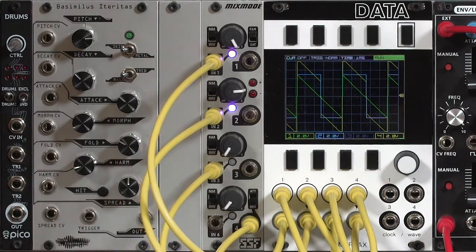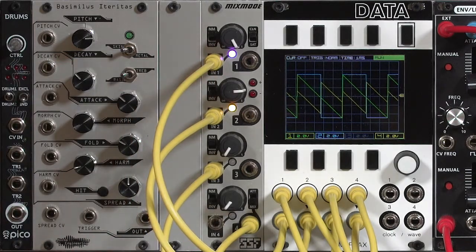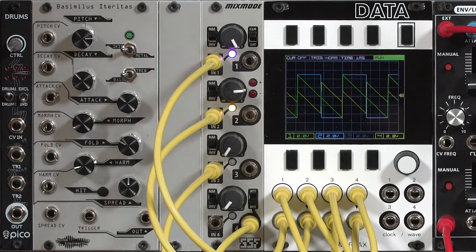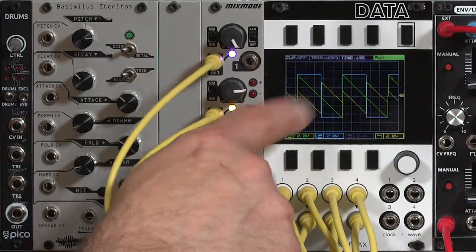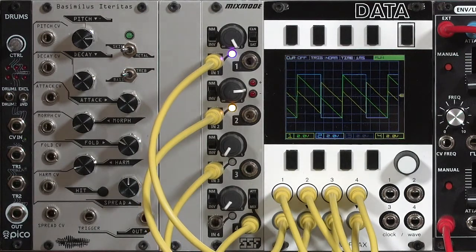As I invert one — in this case the square wave — you'll see the composite wave is quite different. We're kind of building a double frequency sawtooth in this case, as we're inverting the sawtooth partway through by adding an out-of-phase square wave. That's where we're getting the different tonalities out of the sound.